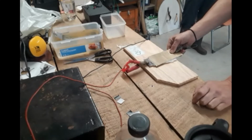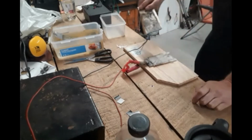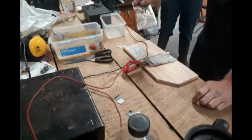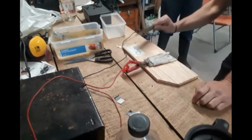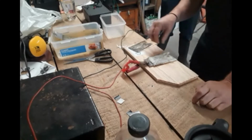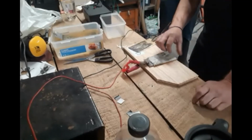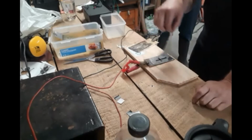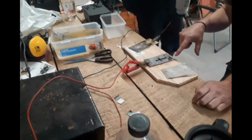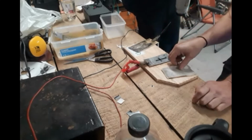Now, yeah, that's getting very hot. And also what you'll see on the underside of this plate, it's gone black. It was that colour, now it's this colour. That is mostly iron. Some of it's going to be sodium. There might even be a little bit of bleach amongst that. And you can see this has gone yellow as well. And if we take this off very carefully, we can see that we've already got the pattern texture of the cloth actually in the metal, but it's not gone everywhere yet. And underneath this resist, it will be perfectly fine.